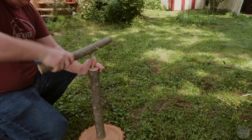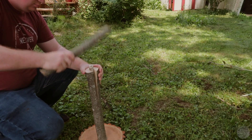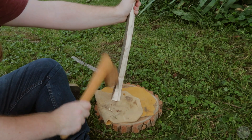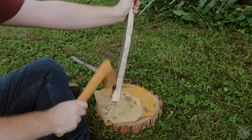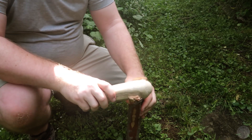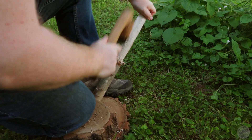Our second wooden component is the cross piece. The wood I'm using was part of a pile of branches dumped by the side of the road. I begin by splitting a large branch in half using a wedge made from moose antler. The spindle will fit through a hole in the center of the cross piece and attach by a cord to the top of said spindle, ultimately providing the torque for spinning the drill by pumping up and down. I begin some of the shaping using an adze, a woodworking tool with a horizontal cutting bit. I quickly realize I can save some time thinning the cross piece by splitting off some of the wood again using the wedge, then continue with the adze to shape it and thin it down. I want to make this somewhat thin and flat, as we will need to create a hole through the center of the cross piece, which will be much easier to do the thinner it is.